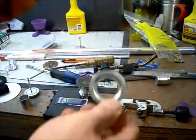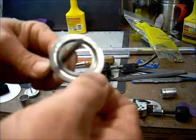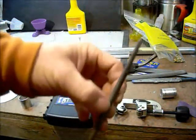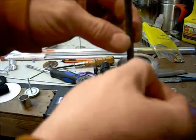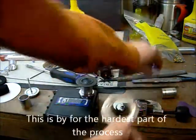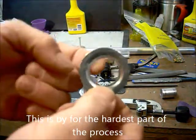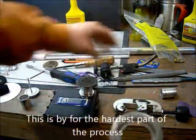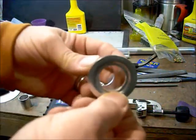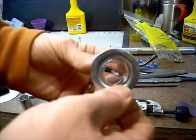So in order to fit it over the top of that, we actually have to file out the inside a little bit. Now that's hard to do — I actually put my file in a drill press, run this up, and just work it around inside the drill press until it files enough of that excess metal away. This is not aluminum, this is steel. So it files enough away that it fits over the pipe. Literally try it until you get it down to the size you want, and then you're good to go.